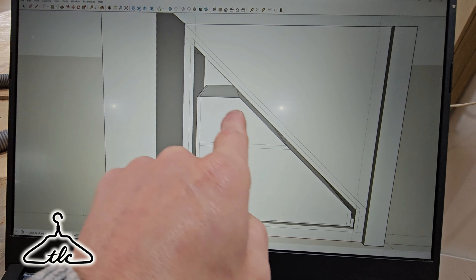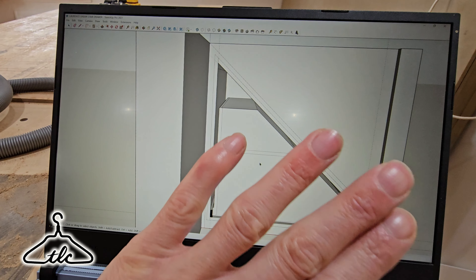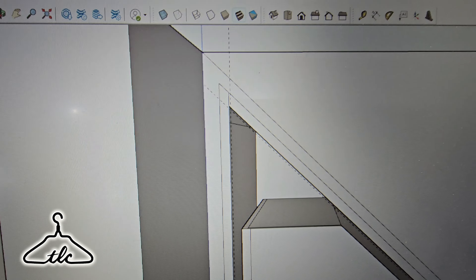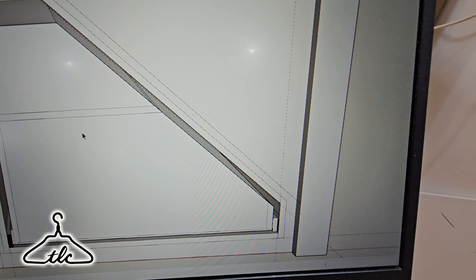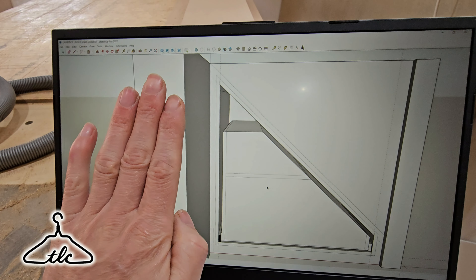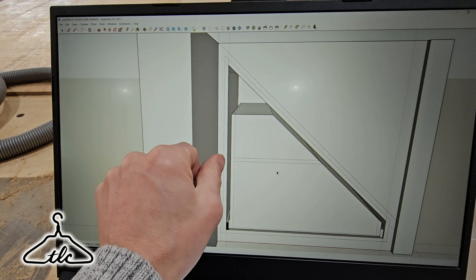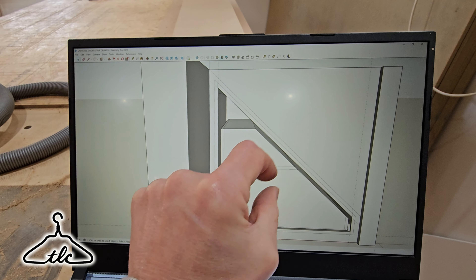This is what we are trying to achieve today. Got one drawer with the shelf in, and this is the framework — the existing wall, the new post of the staircase, and the returning wall. For this carcass it's very simple: just a side, an angle top, another smaller side, and a bottom. The backing plays an important role as it makes it into a solid rigid triangle box.